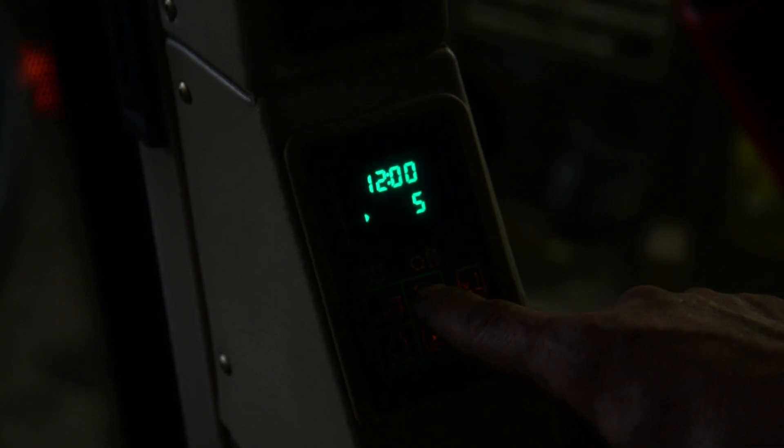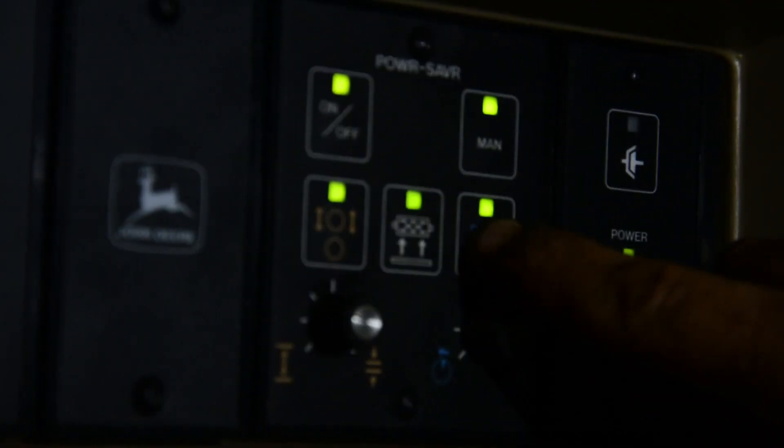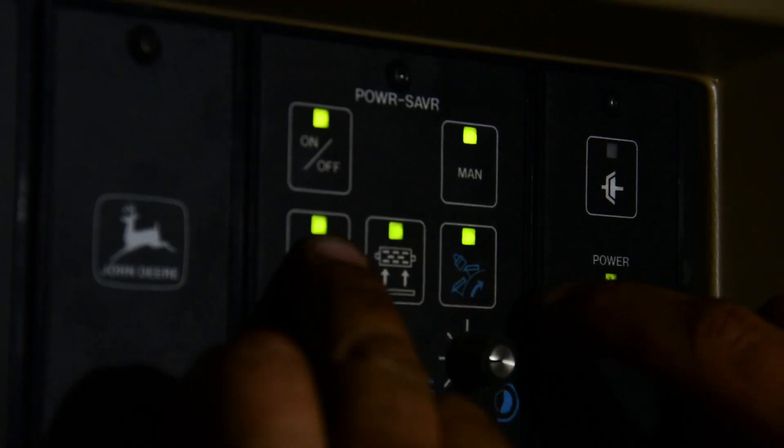Look at your monitor on your right-hand side on the lower column — your InfoTrack monitor. This display is not showing what I'm looking for. You can push the cutter head function; it gives you a numerical number between one through six. I'm already on channel five, which is what I want. You change channels by turning the left-hand knob directly below the pad on the overhead console — just like a radio knob — to move between channels. I want to start with channel number five, then move to the right-hand button and push the far lower right to select that channel.